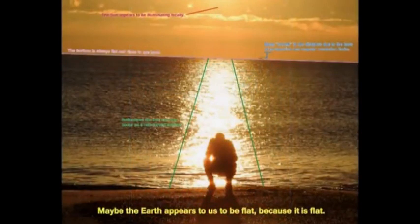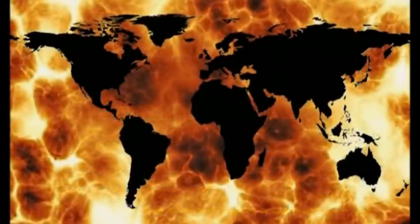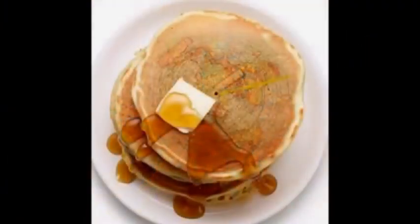Wow. It's insane. But if you have a tiny hair or a tiny speck of dust on the O-ring, and you think it's clean, we've wiped it down with IPA, isopropanol, and put it in there with the vacuum grease and sealed it up, and then you go to pump it down, and all of a sudden it's not pumping down.